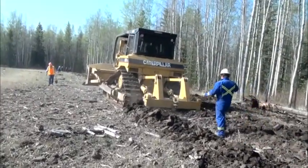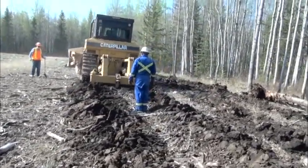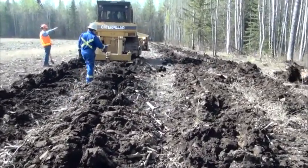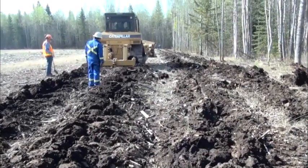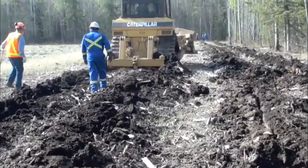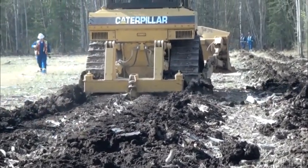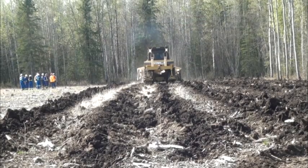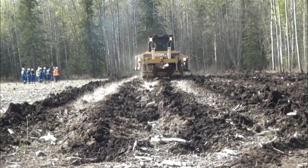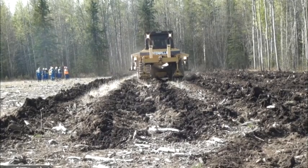Here are our recommendations on how to best use the rip plow to improve the quality of compacted soil and restore its capacity to grow vegetation. Rip plows should be operated at depths greater than 60 cm to increase the closure of adjacent furrows and avoid the mixing of soil layers. The site should be plowed in straight lines whenever possible, at no more than two passes. The passages need to be as equally spaced as possible to avoid disturbing the plowed soil from previous passes.